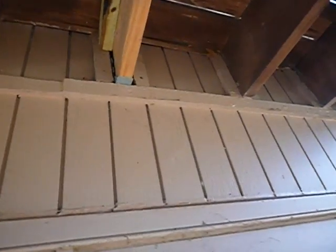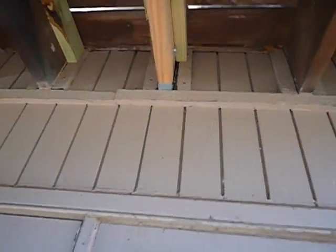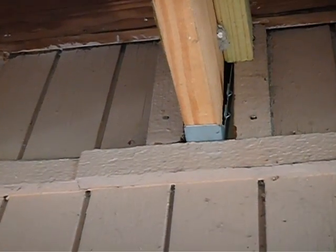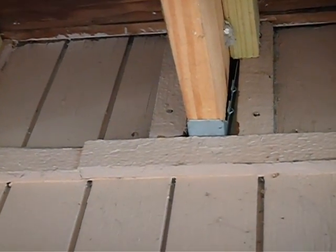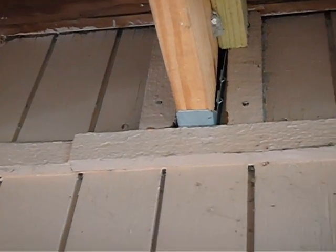Look in here — I see a hanger. All of them should have hangers. I don't see any hangers except for this one. They said they're putting a new one in, but they didn't fasten it. There's no nails in there. No flashing. No fasteners on the hanger that's there. I cannot tell if there are any hangers here. I don't believe it.